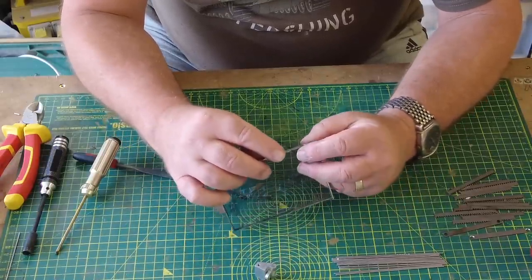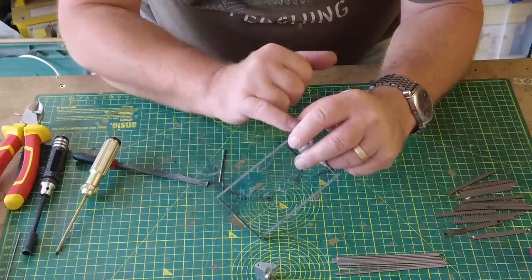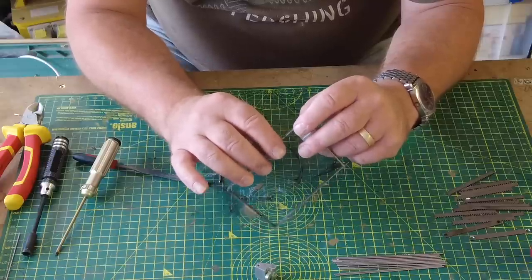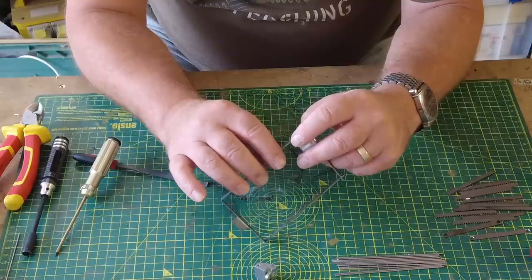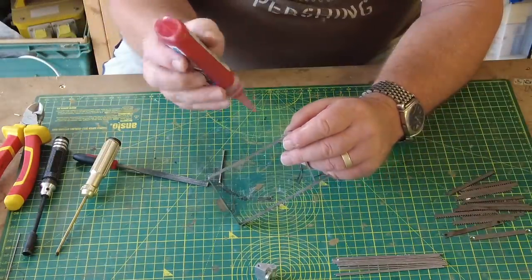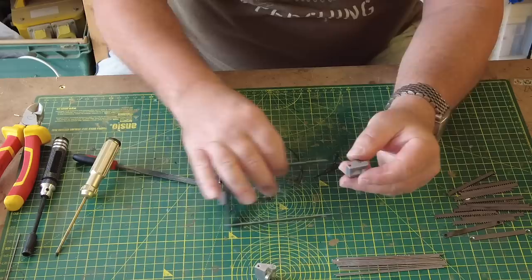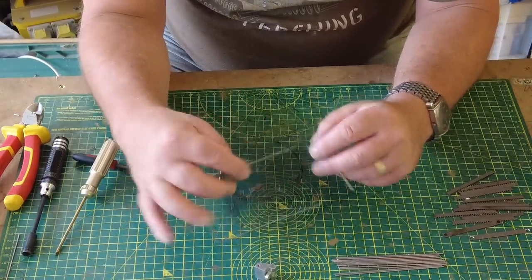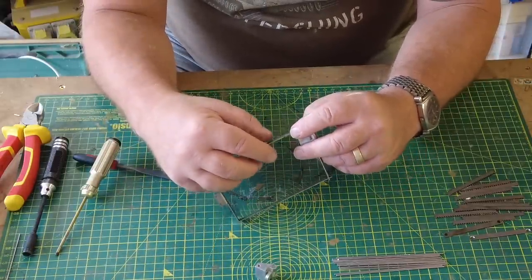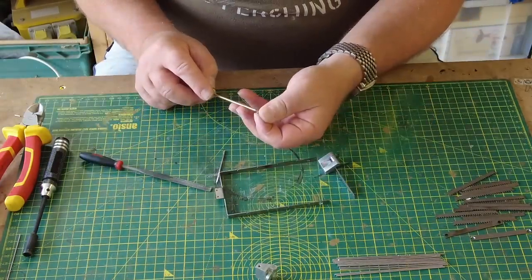Now what I'm going to do is we'll position that on this side. This is where this hole needs to align. And you can see, I think personally they should have had two fixings in this to stop this sort of anchoring here and creating this sort of pivot point. If it had been two fixings, I think it would have got around that. So I'm going to pop a little bit of thread locker in that hole. Making sure I've got this orientation the right way. These little notches are upwards. Down the end of that. Be easier, wouldn't it?